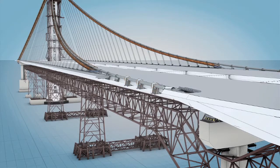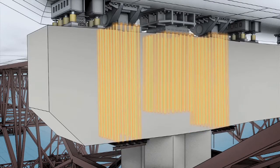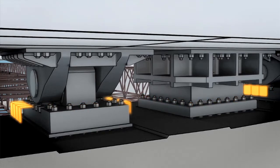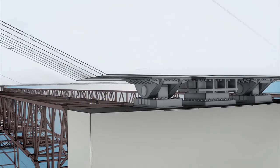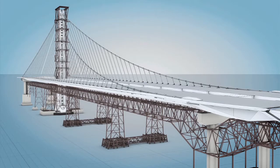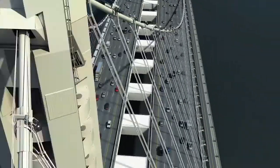Then other hardware can be placed. The bridge is not moving any longer so we can start really locking it down, getting the cowlings on the key areas that we need them. Down here we can return to this part of the bridge where we have the bearings and shear keys and actually pin them in — put the steel rods through this bent cap right here at what we call E2, lock them down with very simple nuts and washers, get the rest of the material in place, then grout them with concrete so that they do not move over our century of use. Once we have that, we can remove the false work. Then we can begin removing the false work — the tower first — and we'll work our way down to the substructure, and we'll have the world's largest and most beautiful self-anchored suspension bridge right here in the Bay Area.